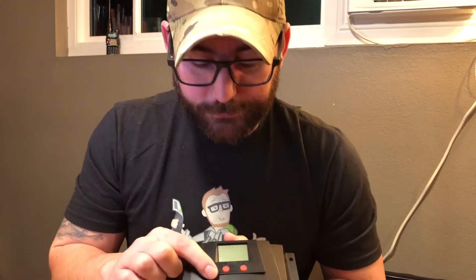That does require that you have solar power — the whole reason of having the batteries is to store that energy and then use it. The charge controller has three sets of terminals: the first is the input from the solar panel, the second is the output to the battery, and the third is the output to a load — which they do not recommend using. The recommended usage is to use the battery connection and then connect your load to your battery.